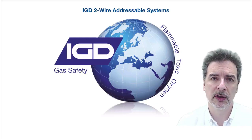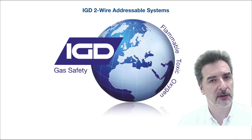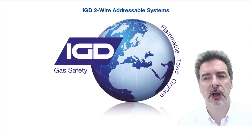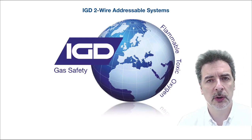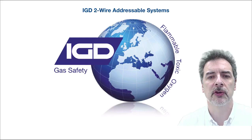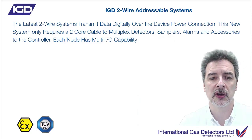Could we go Wi-Fi? We didn't think so because a lot of our detectors are power-hungry, so battery life's a real issue. These are life safety systems, so when we reviewed that we decided that whilst nobody likes installing cables, cables are probably a necessary evil. So we looked at: what's the minimum we can get away with? That's where two-wire addressable systems come from. The idea is that we only need a two-core cable to transmit power and communications at the same time.